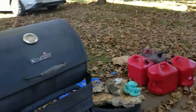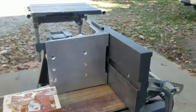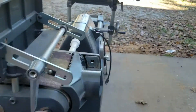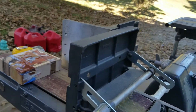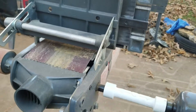You just wedge your board up there, start with one flat side, and start squaring everything up to make yourself a good cube. Just get a little clamp to hold that in place. That's a nifty little trick I enjoy using a lot because I use a lot of rough-cut wood and nothing is 90 degrees. You couldn't do that with eight-foot stock, but if you're doing little boxes and smaller stuff it's pretty nifty. Anyway, that's kind of it for the belt sander. I've got your little adjustments down here using Allen wrenches.